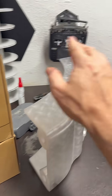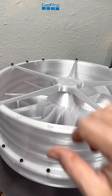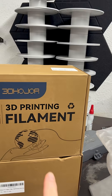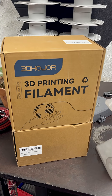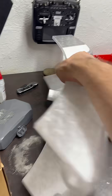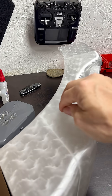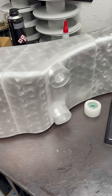We are using some new filament — this is what I did this part with and this part with. This was done with Bambu Lab PETG clear, and this part with this brand. Even with the cardboard spools — there are two spools in here, four total — it doesn't have a problem with the AMS. If you do, just put electrical tape around the edges and it's fine. This is really good PETG, actually very strong. Two-wall thickness only on this, and two percent gyroid infill.